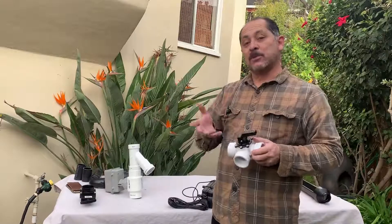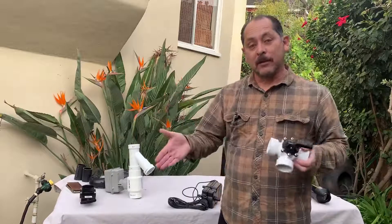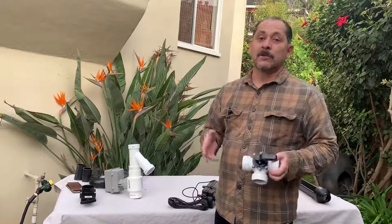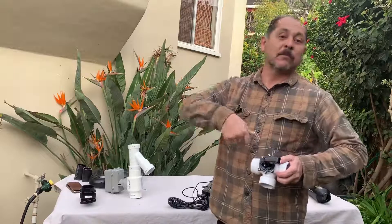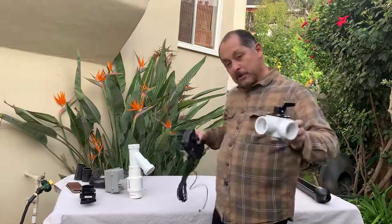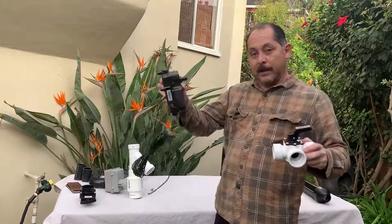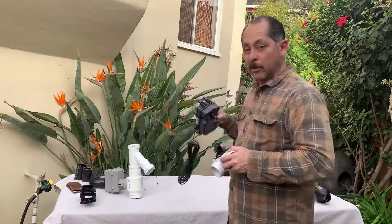It's a nice feature, especially when you're away from the house and have a lot of guests coming over and realize you forgot to switch the gray water system back to sewer because too many people in the house will make the yard too wet. That's actually happened recently — an owner called me and I told them to go to the control panel on their phone and hit zone three to divert to the sewer. So these valves can be used separately or you can add an actuator to control it and connect it to your controller.